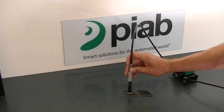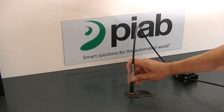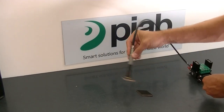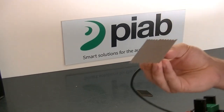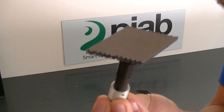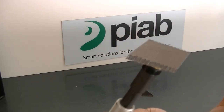As you can see, the product is sticking to the table a little bit because the tape on the underside is coarse, but once I get it off the table I can grab it, move it around, and shake it pretty violently without any movement of the part. As you can see, as I'm pulling vacuum, there is no dimpling or damage to the tape on the underside from the vacuum.